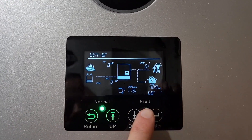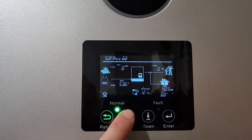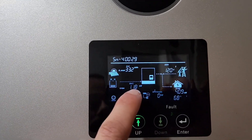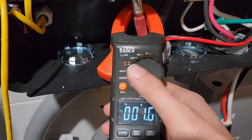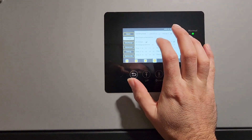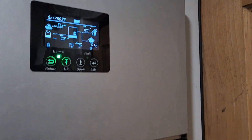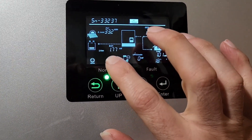However, watch what happens when I hit Enable. So you can see I'm pulling 1.8 kilowatts from the batteries. Let's find my gauge. We got 23 amps. And let's see what happens when I bring this down to 1 kilowatt. Watch down here — now we're charging. We got a 1 kilowatt load and 1.7 kilowatts going to that.